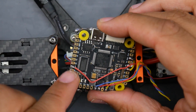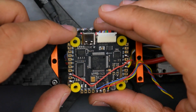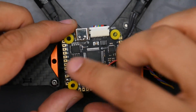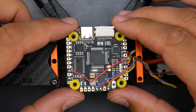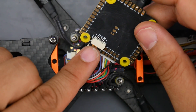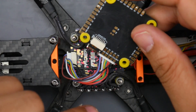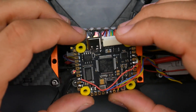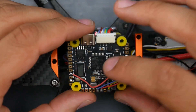When I first got this, I didn't realize some pads are 10 volts — they're hidden by the rubber O-rings. I ended up powering the Caddx Vista off VBAT on 6S and it flew just fine, no issues. Flipping it back over, we also have a connector for the full DJI setup, which is a nice addition. The board is very simple and to the point — we still have an on-screen display and memory onboard.